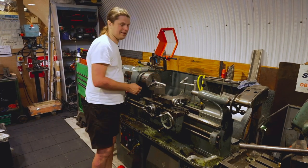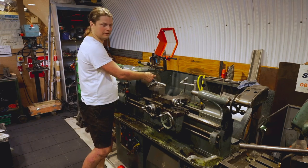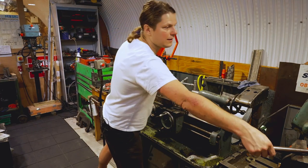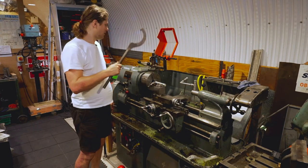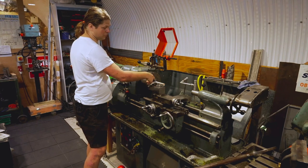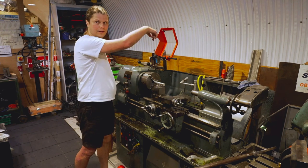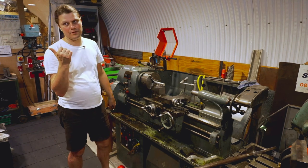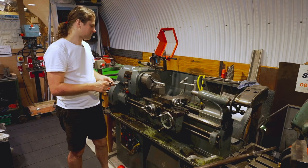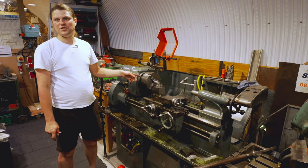The jaws on the chuck have numbers — number one, number two, and number three. You stick jaw number one back in and rotate the key roughly half a turn until it grabs, then stick number two back in, rotate the key, and so on. The chuck has an Archimedes spiral inside that grabs number one, then two, then three sequentially. The way to tell if you've done it properly: you close the chuck back, and if the jaws go into the same point, they're correct — they should fully close at one point.